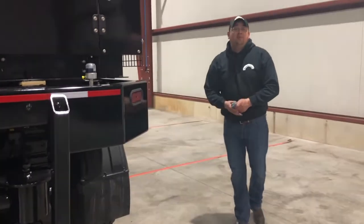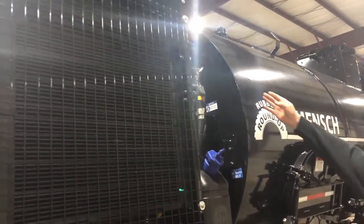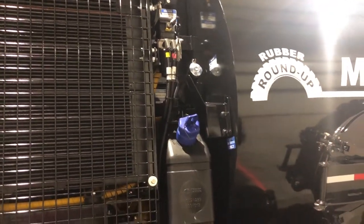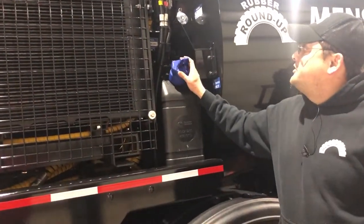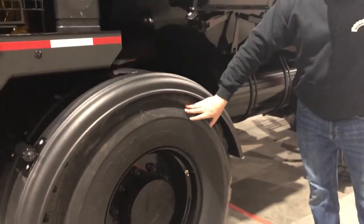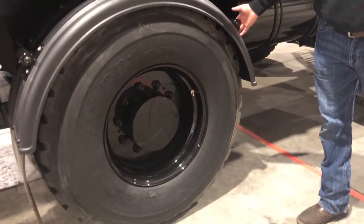On the stage 5 machines, your coolant level is checked out here with a sight glass, as well as the hydraulic oil level which is checked with the sight glass. We need to inspect the fuel tank and the DEF tank to make sure the caps are secure and the hoses and wires are in good condition. We also check this wheel — check for tire inflation, lug nut tension, and condition of the fenders.